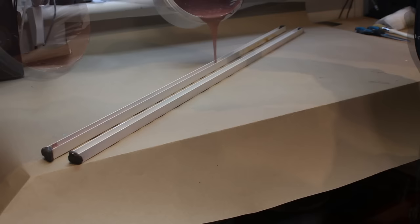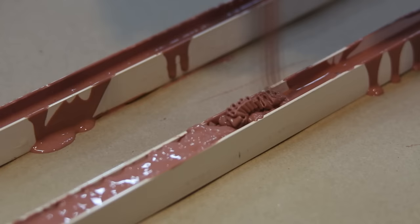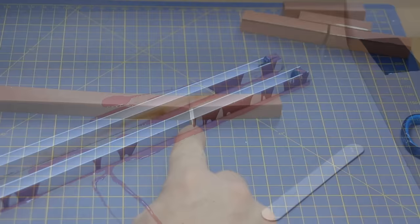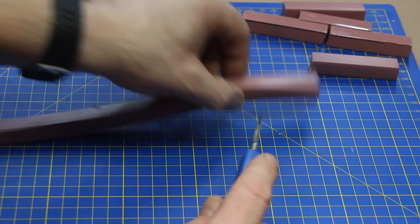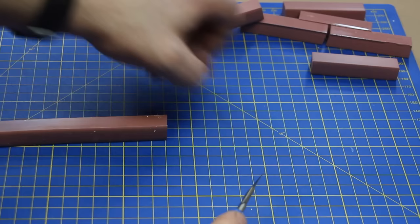While that's setting up I'm making some keys. I've got some U-shaped plastic channel from a hardware store, the ends stopped up with plastiline. I mix up some silicone and fill these two channels to make two long strips — leaving them overnight to set. You need to do this on a level worktop, otherwise the silicone runs to one end and you get a wedge rather than an even strip. Once set, I peel out a long snake of silicone and cut it up into small sections to be used as keys later on — a quick and economical way of producing lots of keys.